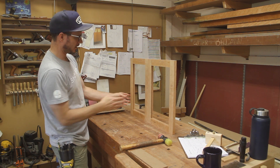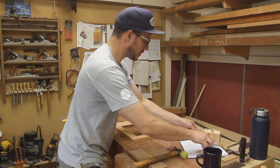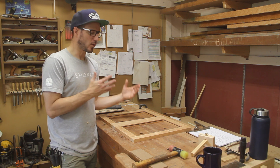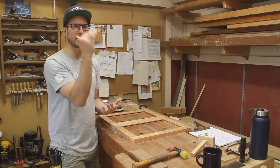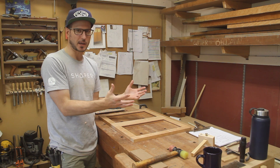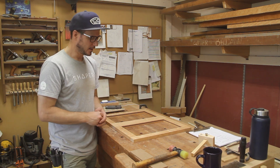The back frame and divider are fitting nicely — the back panel opening is behind the door. Now I'm just double-checking measurements against the plan. I always tell students: don't just go through the cut list and cut everything out exactly — work on the case, and if something changes you can adjust. Measure the actual case and work from that so you're working from reality. Everything looks dead on the plan, so I can trust my panel sizes.